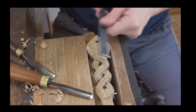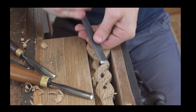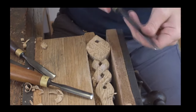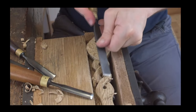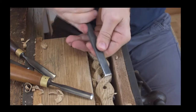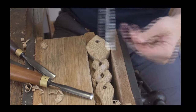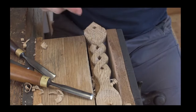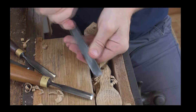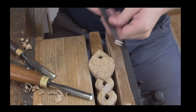You're always thinking about this when you're doing your wood carving — wood needs strength. In order to keep that strength you must avoid carving too deep into the wood, otherwise you lose it. You see it a lot in love spoon carving where strength isn't always taken into consideration. You've got to try your best to carve your love spoon well. This comes into designing — we'll do another live demonstration of designing and talk you through some of the things we're thinking of. When you're designing you have to think: how do we keep strength in what we're doing? Because if your design is too fragile, your carving is more likely to break.